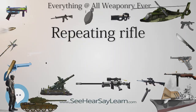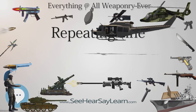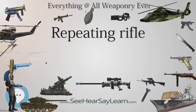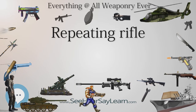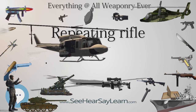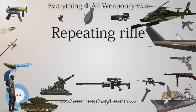Manual Mechanism — Revolver Action: While some early long guns were made using the revolver mechanism popular in handguns, these did not have longevity in the marketplace. Although the revolver mechanism was fine for pistols, it posed a problem with long guns — without special sealing details, the cylinder produces a gas discharge close to the face when the weapon is fired from the shoulder, as was a common approach with rifles.